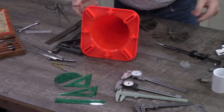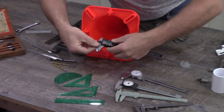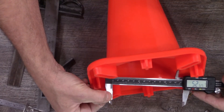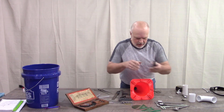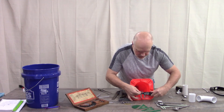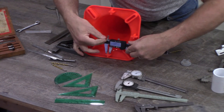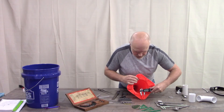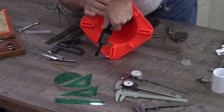As far as the inside dimensions go, this is probably small enough that I can measure it with my digital calipers. We can get in here and get the measurement across the inside diameter. Then for all of the other measurements — we can measure across the high side of each of these features, the width of each one, and the same thing with the feet: the width across that way and the height up and down.